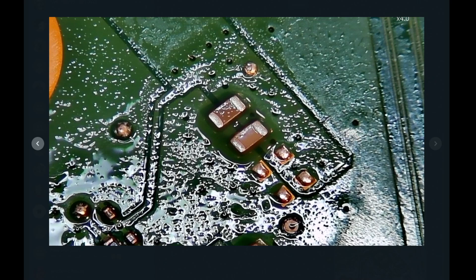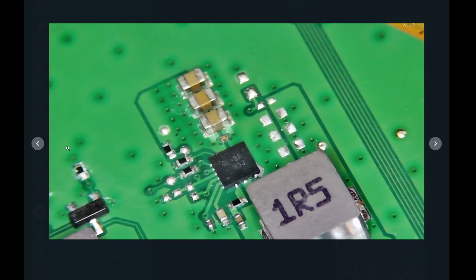The second one is also 20 microfarads probably. I had 10 microfarad 0603 size capacitors, so I asked my technician to put two tens in because that's the same value on the same line — and it was fine. The part is marked something like QL minus 8F and 4-5J or N5J.